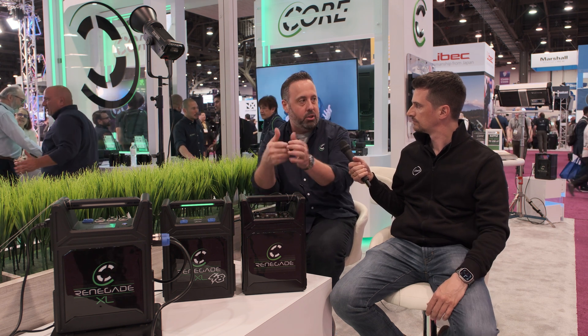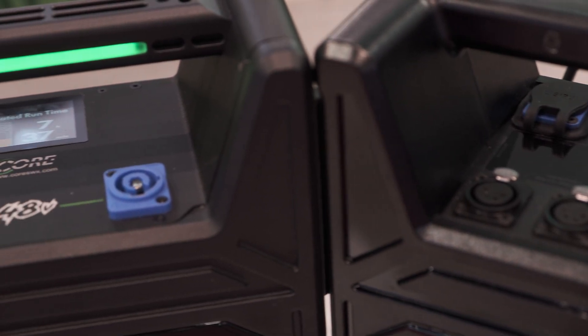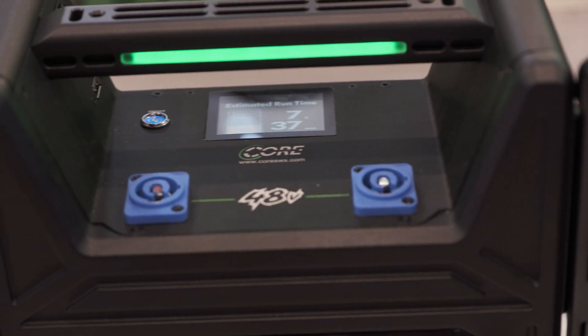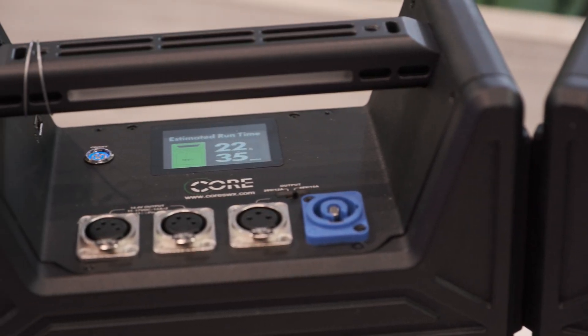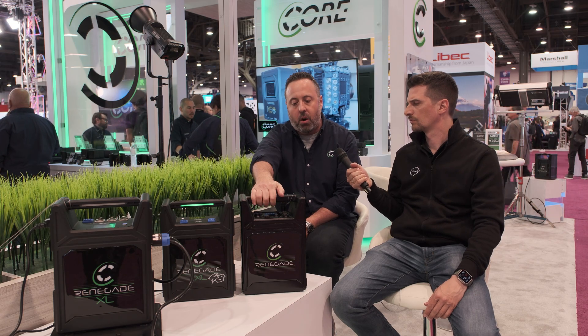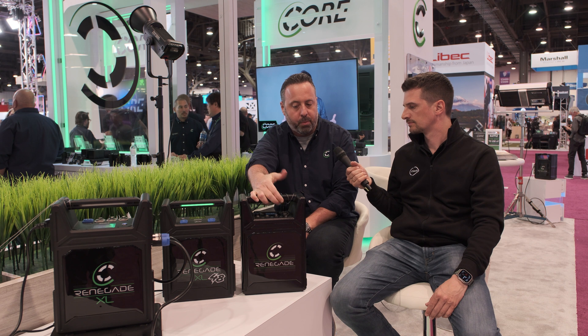The other great thing is what we're coining now — the thought is to same-day cycle the battery packs. If we can charge the packs faster than the user consumes the power, that's a win for the user. The 777 watt hour capacity charges in three and a half hours with an external charger. So really fast — on normal AC mains, 100 to 240.